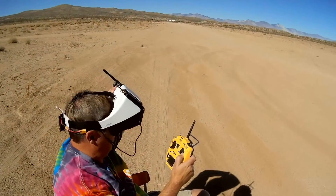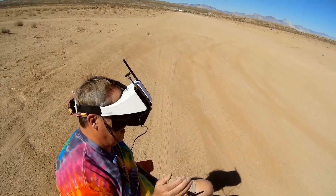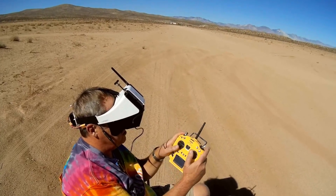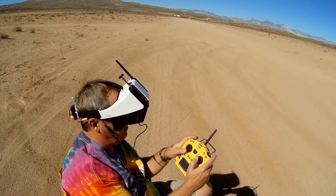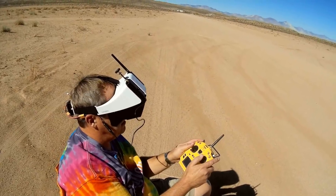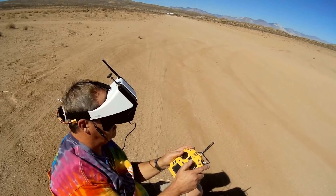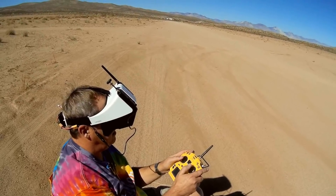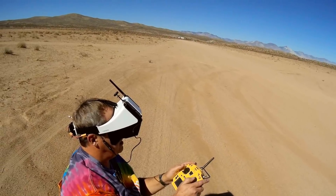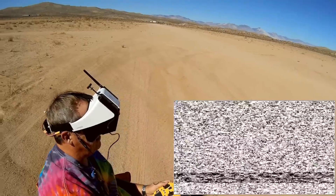Okay, I'm ready to go. I'm putting these goggles on my head. Yesterday I was trying to fly this and was not impressed at all with the transmission power — I think my antenna was the problem. One thing I want to show you is the smart audio settings. To activate it, bring the throttle to mid-position and move it left, then push the right stick all the way up. That brings up the menus, and you can navigate with the right stick. You can go into Features, then Video Transmitter, and change channels, frequencies, and power levels. I've set it at 200 milliwatts.